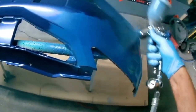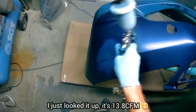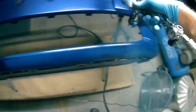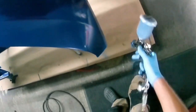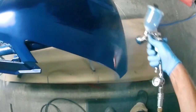This is the WB2 version. One of the drawbacks immediately is it uses quite a lot of air - 390 liters a minute, which is about 14 and a half CFM. So if you're thinking of getting one of these for home use, you need a good air supply, otherwise it's not going to keep up. The output of these also isn't particularly great - and I don't mean the quality of the output, I mean the amount of material these things put out.